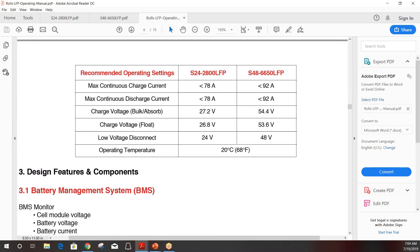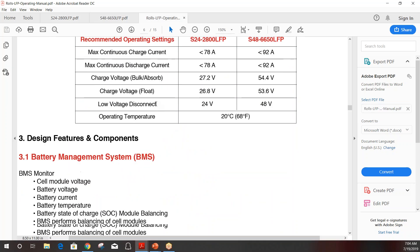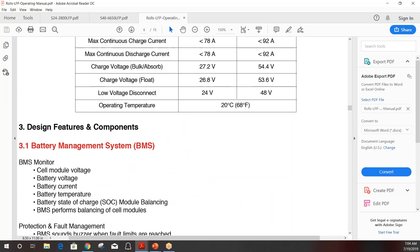If I pop open the manual — there's a link on this YouTube page for both the manual and the individual spec sheets, linked in the YouTube description. For this particular model: continuous charge output for the 24-volt model is 110 amps DC; charge voltage is 27.2V for the 24-volt model and 54.4V for the 48-volt model. Operating voltage is 22V to 29V, or 44.8V to 58.4V for the 48-volt model. While charging, 0°C to 45°C are your maximum limits — you will not be able to charge these batteries outside those numbers. Discharging can be done from negative 20°C to 50°C. The spec sheets and operating manual are linked in the description below for more detailed information.